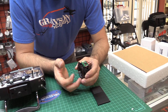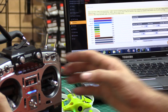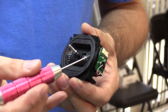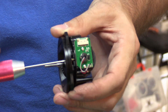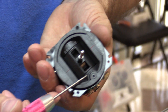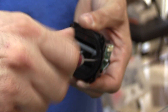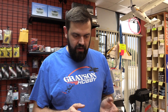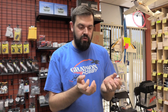You get jittery centers, you lose your centers, it wears out over time — that's when the sticks start going bad. With Hall Effect, magnet deterioration means you'll probably be dead before the magnet's no good. The whole point is a very precise system that's more reliable and less likely to develop drifting centers. Another cool thing: the gimbal has a slight inward and outward tilt adjustment via a little wheel. Once installed in the radio, you have a few degrees of adjustment, which is nice depending on how you hold the radio — it can help reduce unintended yaw input whether you're a thumber or a pincher.